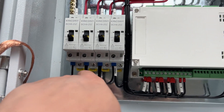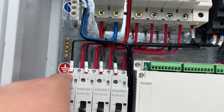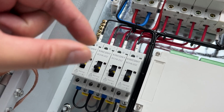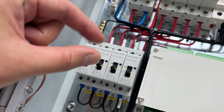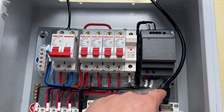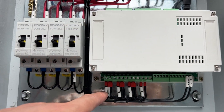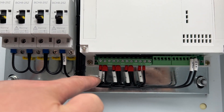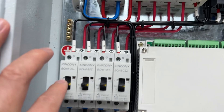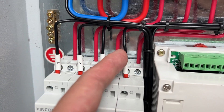You can see the ground has been connected together. When this contactor has output signal to the positive point and 12V, the contactor coil will be closed. Without voltage, the contact will be open. You can see the two Ethernet cables connected to my router. You can also use Wi-Fi. This is the 12V power supply for the A4S board, and the digital relay output — channels 1, 2, 3, 4 — connected to the contactor coil.